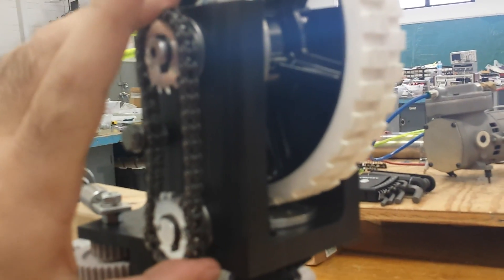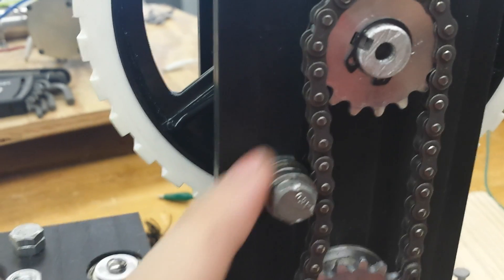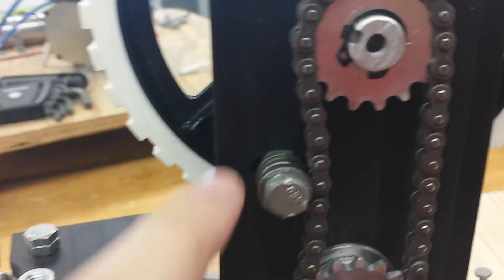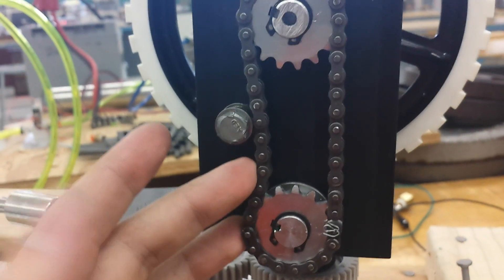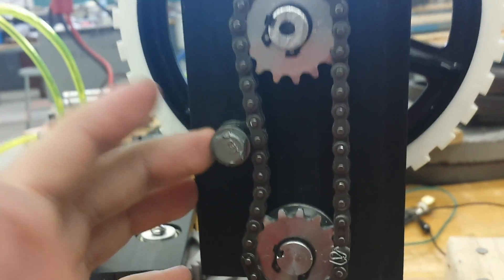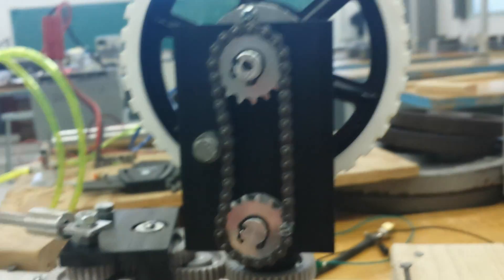The shifter is set for a 2-to-1 ratio, but the fine-tuning can be controlled by these sprockets, which is one of the big advantages of doing it this way. As you see in the CAD, we just have a chain tensioner here, which is a bolt with two quarter-inch bearings. This could be sleeve bearings — this could be one of several things. We just have these laying around inside the slot, which is very easily adjustable. So between each match as needed, we could adjust the tension without it being much of an issue. We usually avoid using chain under high-force situations because it stretches and the performance is a little bit different every round because it keeps stretching. So with this tensioner here, we could adjust it on the fly very easily — just loosen it, push it on, tighten it, and be done with it. It's just a couple-second fix.